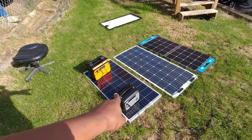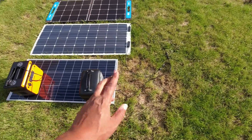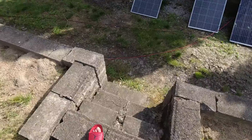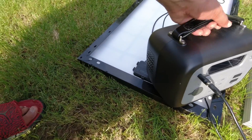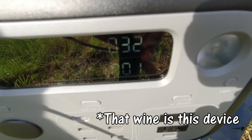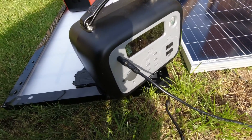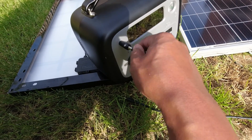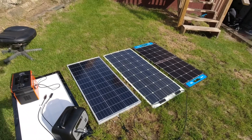For the Ocotel we're all connected up — this panel is getting 42 watts. Now I'm gonna try the Renogy flex next and compare, doing it relatively quickly. I have the benefit of more than one cable so I don't have to keep unplugging. The sun conditions are similar but not identical since I had to grab a new cable. We're getting about 35 watts on the flex — the cable is super short, sorry about that. I pop the other one in and it's doing 34 to 36 watts as well. So laying flat, both are producing around 35 watts.